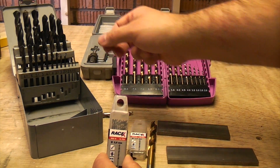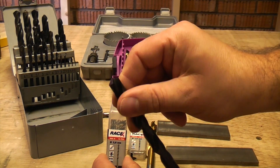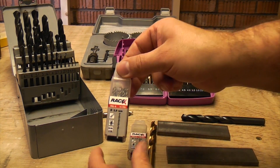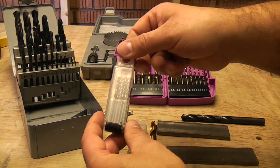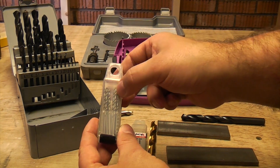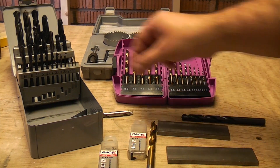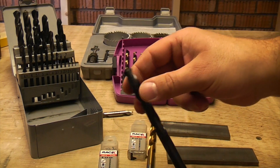If you wanted to drill a large hole in metal — let's say something that size — you wouldn't start off with a large drill bit because it'd be too big. So what you do is make a pilot hole first; that's where the small drill bits come in, like this. You pop through first with a small drill, which is two millimetres, and then you can progressively move up to larger drill bits — or you could just go straight through with the larger one if it is sharp.